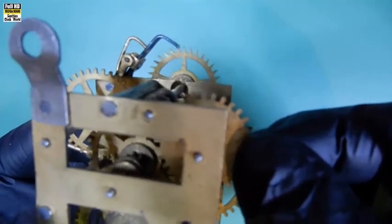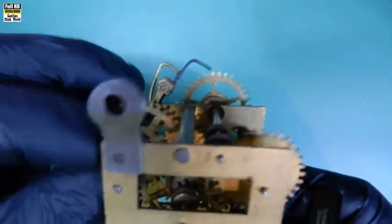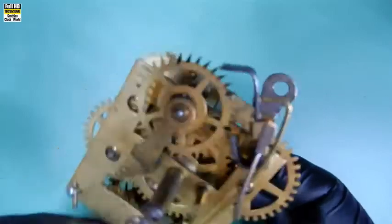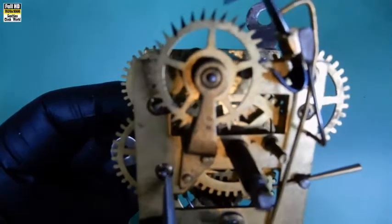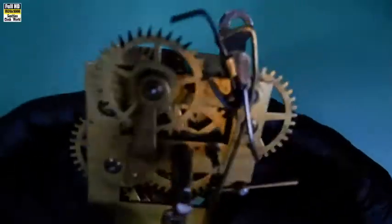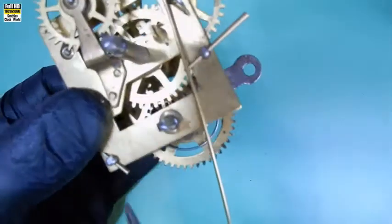The third wheel - terribly loose. I think it's had a fair bit of work, this movement. Same condition - they're all seriously worn out. Turning it round to the front, checking a couple of the front ones - shake it backwards and forwards, sideways - look at the movement in that.